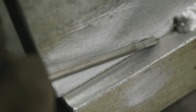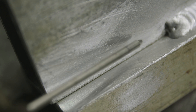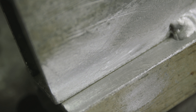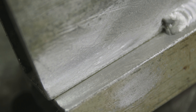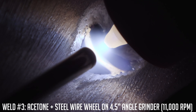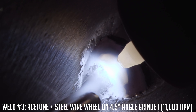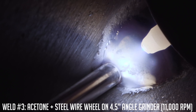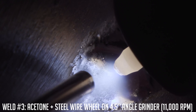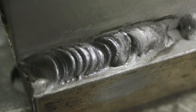You can see the surface has what they call a 'raspberry effect' — little bumps and dimples all along there where contamination ended up in those little pockets. In this demonstration we're using a regular steel wire wheel, which compounds the problem by adding additional contaminants into the weld metal. That's what a lot of people do because it's what they have — carbon wire wheels in the gang box because the company bought them to save money. As you can see, that one welded pretty nasty with a lot of surface contaminants coming up. The weld just looks terrible on the exterior. I highly recommend you don't do it that way.